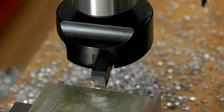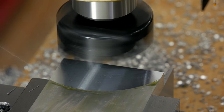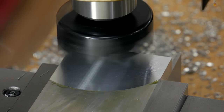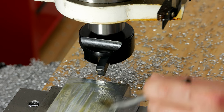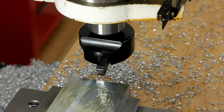Usually because you can get a really nice finish. I don't have a face mill big enough to get this all in one go, so I'm going with the fly cutter. This is just some A9 cutting fluid for aluminum. I'm going to touch off here and get started. This is the final cut on the bottom — or I guess it would actually be the top. I've turned the feed down and the RPM down trying to get a better finish. I don't need to hog off a bunch of material now, so let's see how it does.